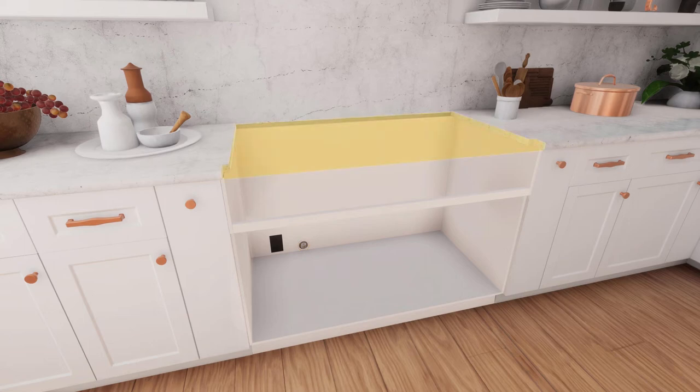These range tops are designed to hang from the countertop by their side flanges. Smooth any rough edges on the countertop before installing the range top. Formica countertop edges must be finished. The countertop must be strong enough to support the weight of the range top.